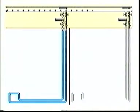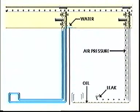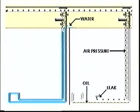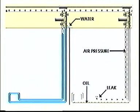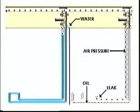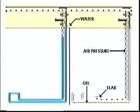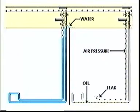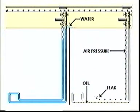In our vessel, the coils are kept full of fresh water when they're not used, making it easier to check them for leaks. Checking is done by first pressurizing the main steam line with air. The drain cock at the return side of the coil is opened. Now open the inlet valve, and if there is no problem, clean water should come flowing through the drain cock quite quickly. If there is no water in a coil, this indicates a problem, most likely a leaking coil. Coils containing oil must be properly flushed with water to remove all oil.